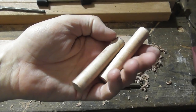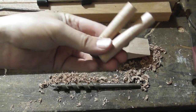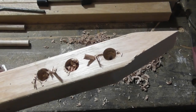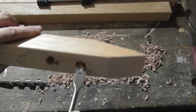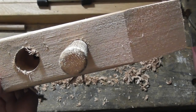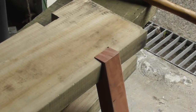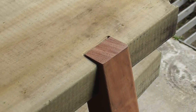Before I get too carried away — I've still got another 30 or so to go — I need to make sure this is going to work. I scrounged around my drill bits. These are 15mm. I have a 15mm auger bit but it tends to damage the timber. I want it to look fairly good. So I found that if I use a 16mm bit to just break the surface, and then go through with the auger bit, it ends up pretty good — just a slight gap at the edge. I've got the approximate height set up to make it easy to put the legs on. Hammered in the first one — bit of a tight fit — and I'll leave it slightly proud at the top and sand that off later.